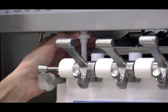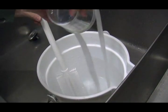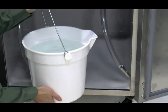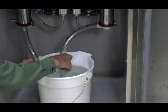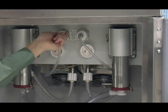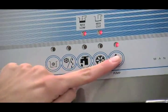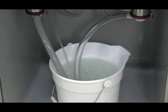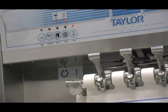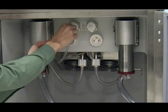Place the power switch in the OFF position and close the prime plug. Cleaning: prepare a pail of approved 100 ppm cleaning solution. Place the pail of cleaning solution inside the mix cabinet and insert the suction line. Disconnect the pressure line from the pressure switch and place it in the pail of cleaning solution. Press the pump key. This action will cause the cleaning solution to be pumped through the air mix pump and out through the pressure line. After approximately 15 seconds, press the pump key to stop operation. Connect the free end of the pressure line to the pressure switch.